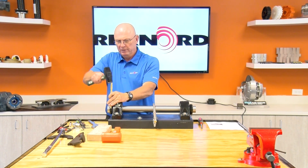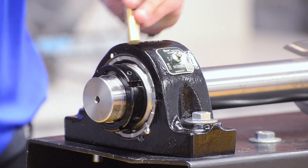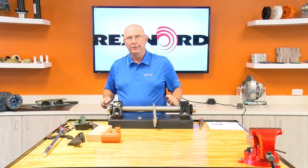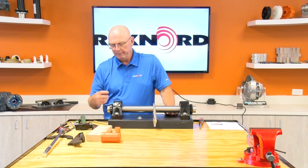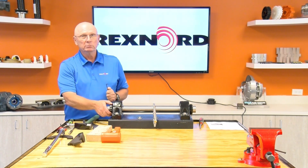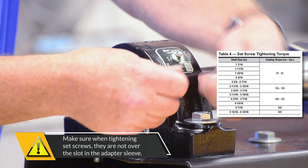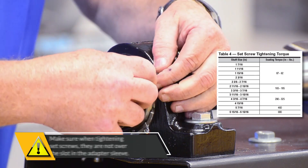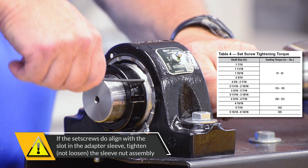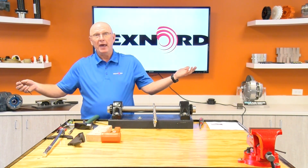I've got the zero position marked. I'll mark the sleeve, mark the shaft, and mark the nut so I know where I'm at. There's 90 degrees, and another 90. I'm going to keep going until I get to one turn — one to one-and-a-quarter revolutions. At that point, those two set screws that I loosened have to be tightened. There is a torque spec in the service instructions, or you use the tried-and-true method: tighten until the wrench almost yields — when it almost yields, you're tight enough. Once you've got those two set screws tightened, you're done.